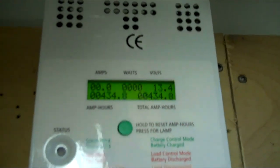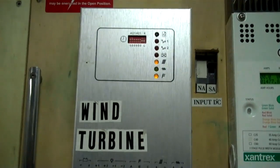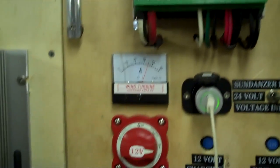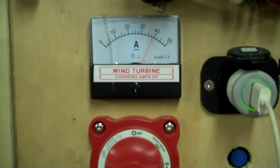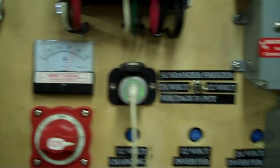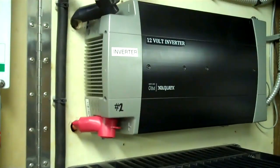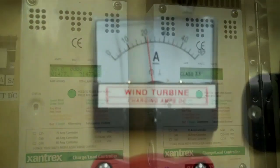Definitely works for when the batteries need a little help. Both freezers are on there, and we're at 13.1 volts, and this thing's actually starting to go into diversion load — it's charging a little bit too hard. You see that needle start to jump around like that. It's windy for sure, but I'll stick with the solar if I had my choice, but sometimes the wind is fine.